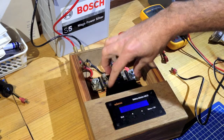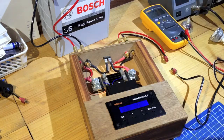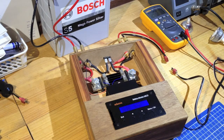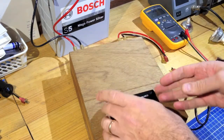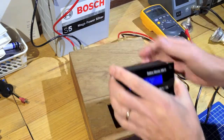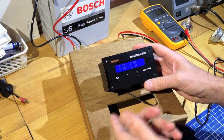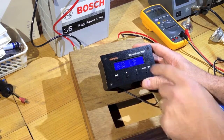The temperature is read at the sense unit. The sense unit has a thermometer inside and is showing 22.6 degrees Celsius. The reason for the temperature being at the sense unit is that it takes account of the battery voltage to allow for how full the battery is, and also to work out the state of charge based on the current voltage on the rare times it does that. That gets us up and running. The unit itself is fairly straightforward to use — you've got four buttons: Exit always gets you out of whatever you're currently in, Menu takes you into the menus or accepts an entry, and Left and Right take you through various options.